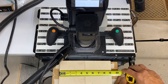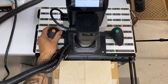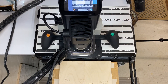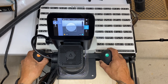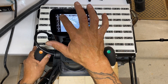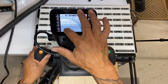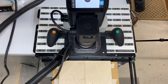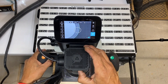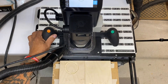Now that I have a grid established — and actually there are three different ways to make a grid — here I'm just going to measure approximately where I want in these scrap pieces of wood, and I can use that grid system to place the circle. I just punch in the number 2.469 and the machine will remind you to do a Z-touch, which is the Z-axis. You can see the machine drop down right there, and as simple as that, we are ready to start cutting. I love this machine.